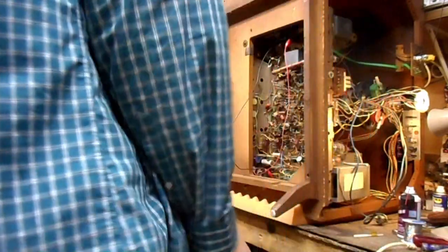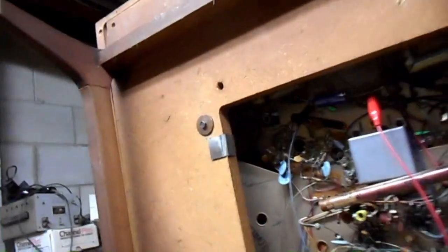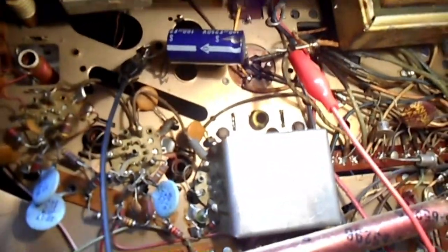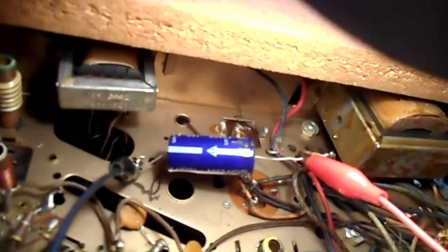So let's pull the power so that the B plus doesn't have active electricity to shock me with, because I don't like getting shocked. Let me show you the cap that's failed. You see this modern blue capacitor that's 100 micro at 250 volts and how the plastic casing comes off of it. Jumping a new cap across that's getting us back a hum-free, fuller horizontal, so clearly this capacitor's failed. And it is the circular section of C2.